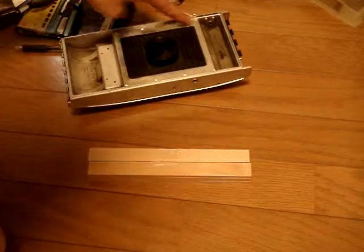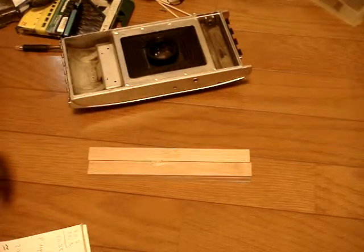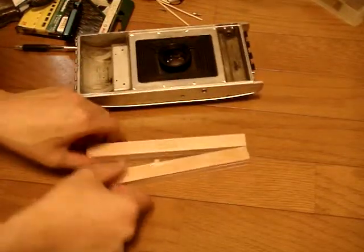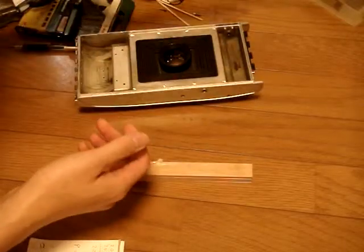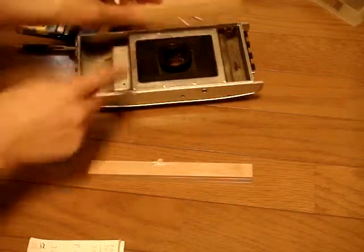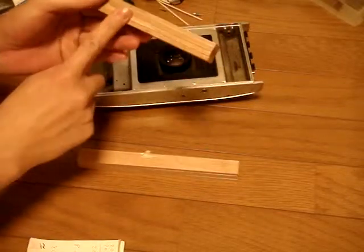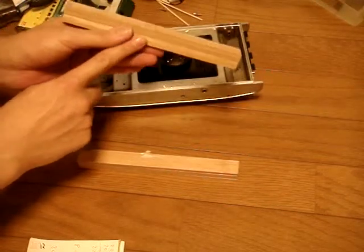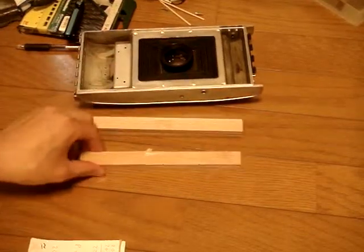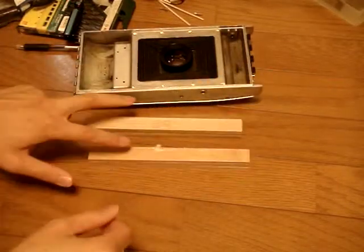Back inside, I've removed these two spacers. We need to calculate how thick the spacers need to be for proper infinity focus. I removed them with the tape still on, including the piece used to attach to the camera body, and measured the thickness of both. One was 20.2mm and one was 20.3mm. Because they're different, I decided to take the average, so that's 20.25mm.